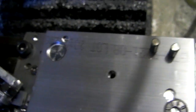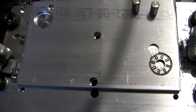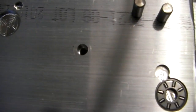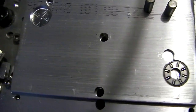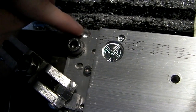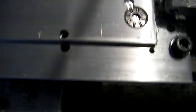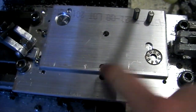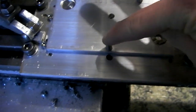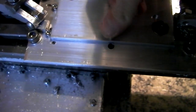So I had to figure out why that problem happened. It took me a long time. I had to measure every single hole in my fixture plate to figure out why. They were pretty much 23 thousandths of an inch off to the left and down. I finally figured out why — it all boiled down to this hole being in the wrong position. So I've fixed it now, and I'll make another one. These holes are locator holes, so that I can take these quarter-inch stainless dowel pins and drop them in there, and that way it will locate perfectly into the fixture every time.